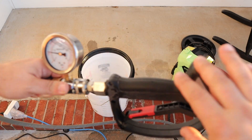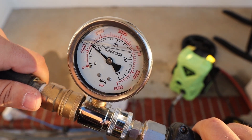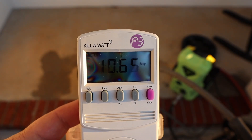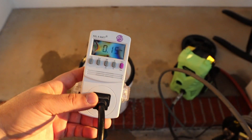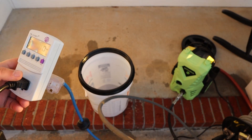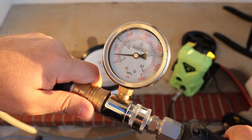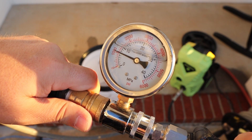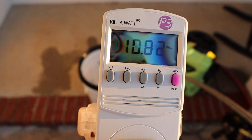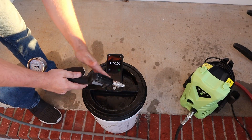Stepping up to a 1.5 nozzle gives the same result — goes to 1,400 PSI and just shuts off. We got 12.3 amps for a moment, still in the safe zone, but the machine just can't handle it. At the 2.0 nozzle, we get a constant pressure of about 1,090 PSI at a safe 10.7 to 10.8 amps. Now that we've got constant pressure, we can test the 2.0 GPM — measuring about 1.25 gallons per minute on the 2.0 nozzle.